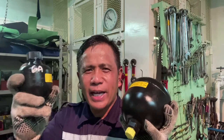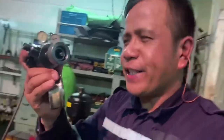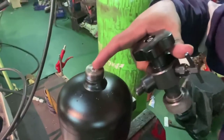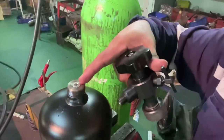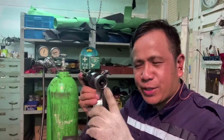This is now the accumulator — this is the outlet and this is the inlet. We can now check the pressure after taking it out from the lubricator unit. Before inserting these tools to this accumulator, make sure you slack a little bit this screw to avoid damage to your tools.